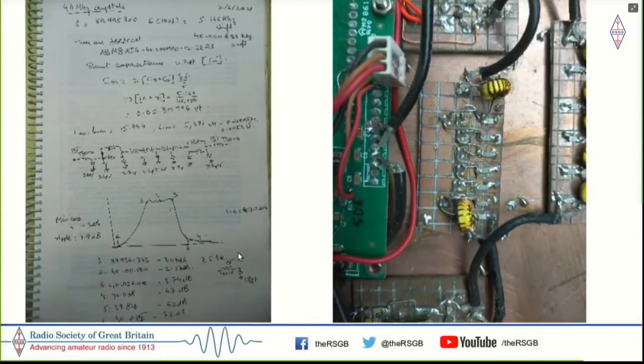The next thing that I did was to migrate this from 27 to 40 megahertz. Bought some crystals off Mouser. I'm sorry, the left side is pixelated, but nevertheless, I put this into the SDR that I was developing. And here on the right, you can see the crystal filter. Now, these crystals are not available in the HC49U format. They are SMD crystals, and they were really, really impossible to solder.